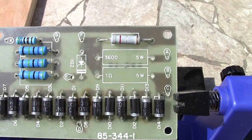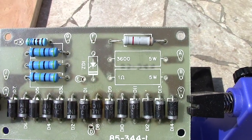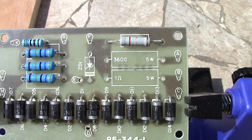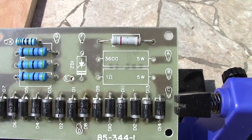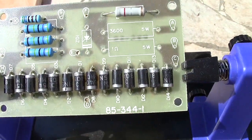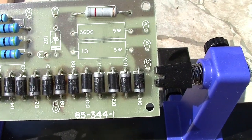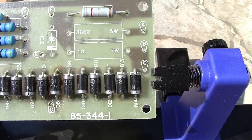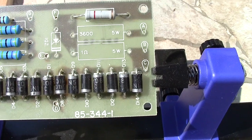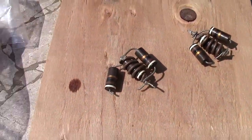What you should always do is check the 0.82 ohm resistor in the upper right. If that's burned out, chances are the zener diode is burned out too due to some kind of failure. I always try to figure out why these units failed before doing any work on them. What I found on this one was that D2 through D6 - the diodes on your left on the bottom - were all open. D1 had been replaced by a former owner; apparently it was open and he put a new diode in. Generally, when you pop a diode it's because you've got a shorted capacitor somewhere.